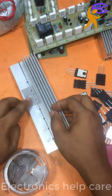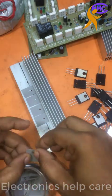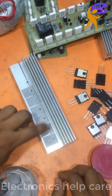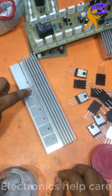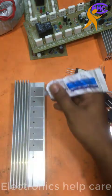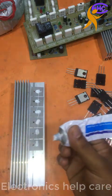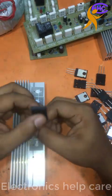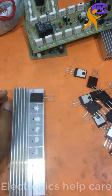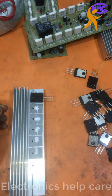The transistor needs one separator to separate the voltage from the heat sink. There are six separators, six separators. Thermal paste is also used here. That is this — six 2SC5200 positive transistors.